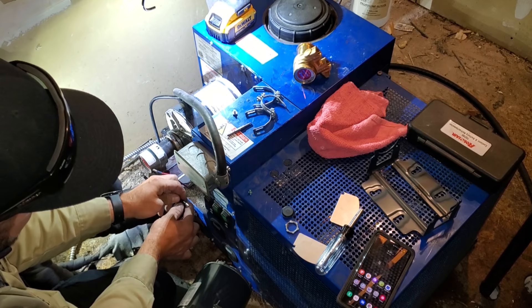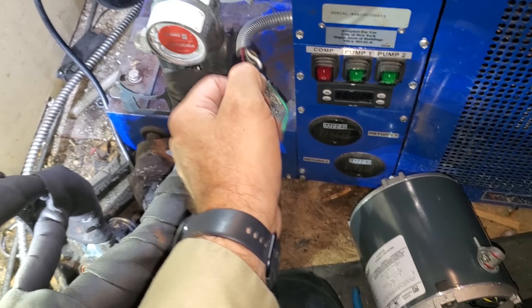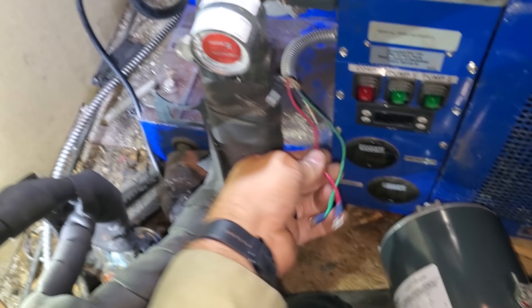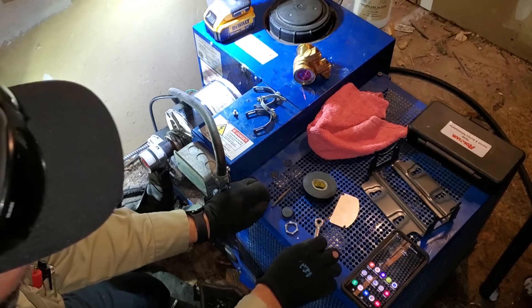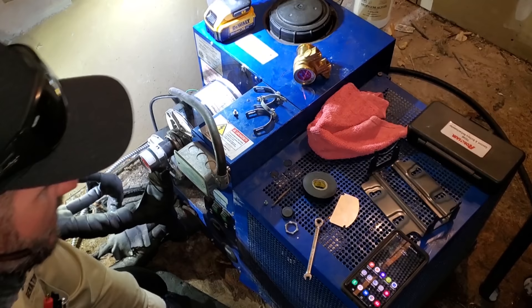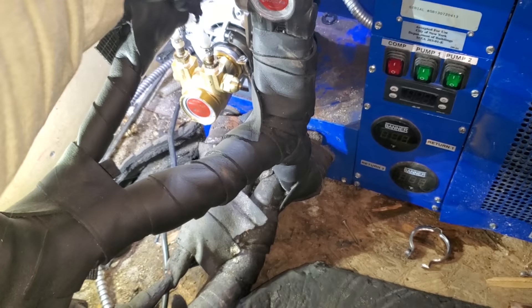The common wire neutral is slightly exposed — just going to give it a tape. It's like they didn't push the wire far enough into the fitting. This unit actually does have a dedicated ground, so the ground to the housing isn't as critical after all. Still, it was a little sketchy to see that ground cut off. Got a tiny quarter-inch ratchet wrench — hopefully I can get that ground screw on the back. Pump's in, and I still need to insulate everything, but I want to make sure it's working and there are no leaks before I insulate.